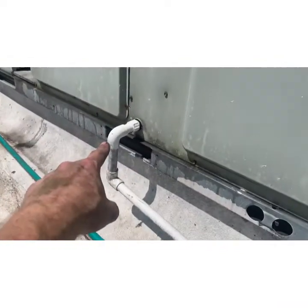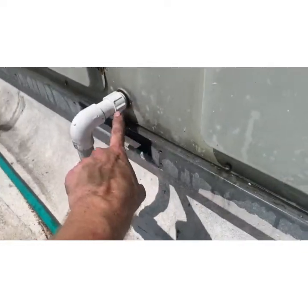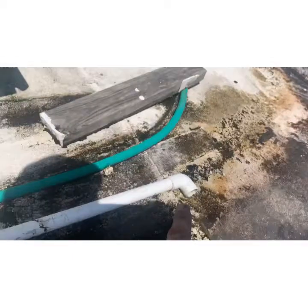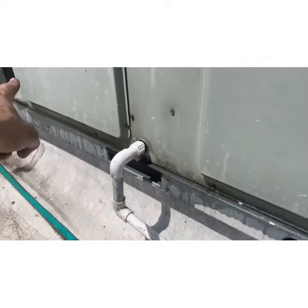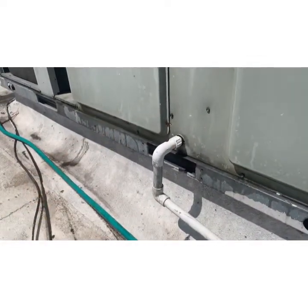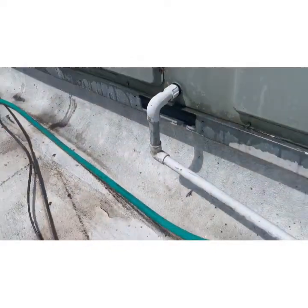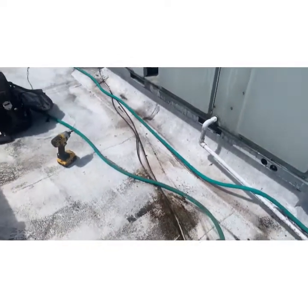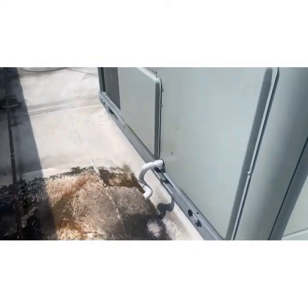There's no trap. If there's no trap, the very bottom of this pipe has water leaving, but the top is sucking air back in, and it's blowing that water into the system. You're going to get leaks in your roof and mold in your ducts. There has to be a trap on every air conditioner.